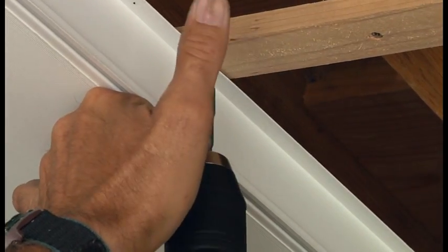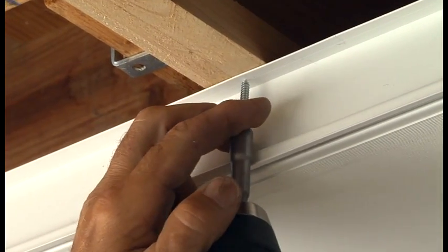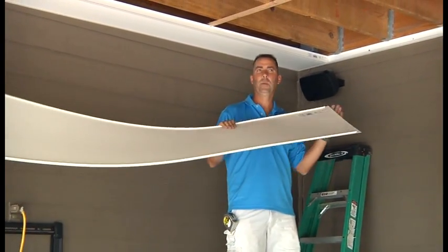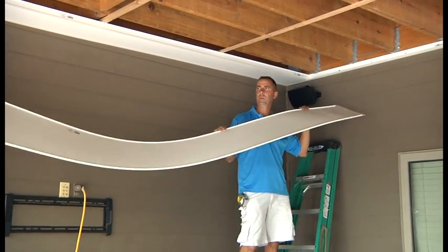We started at our half inch pitch spacer. You don't want to drive the screw through so far that it damages the rail — you just want to snug them up. After the first panel is installed against the wall, we just repeat the same process over and over until we get to the opposite end where we need to start doing some more cutting.